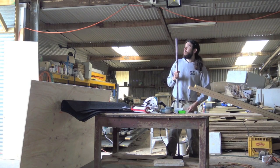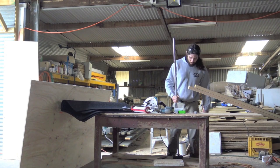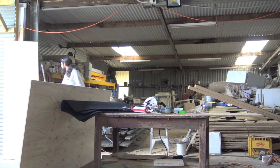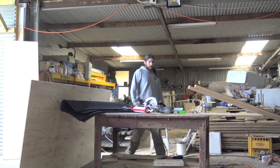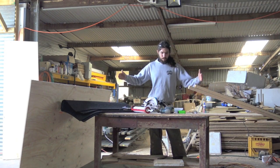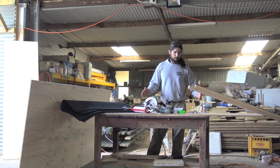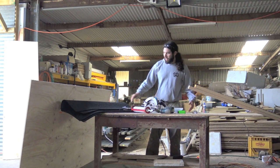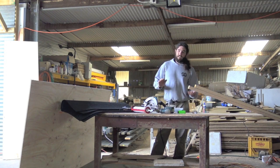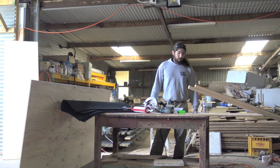So I've got this bar which is a 6-foot bar, which is only a short one at the moment, but I'm just about to upgrade to a bigger bar, so I'm going to allow for the bigger bar. So that will give me about 1100 for the platform. So the timber panel, which will be made out of plywood, will be 1100 in the middle, and then the rest of the edges will be made up by this 12mm rubber matting, so it's all nice and flush and all at the same height, so you don't get any deficit out of the platform to start with. So let's start cutting some stuff up.